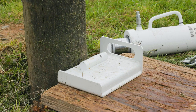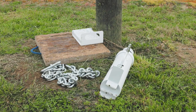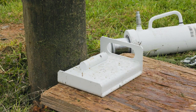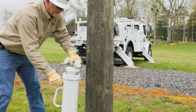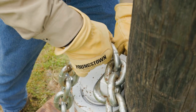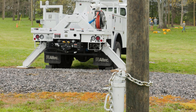Remove the pole puller from the unit or storage location and set it on the ground. Both types of pullers use a chain assembly and hydraulic cylinder to grip and lift the pole. We'll look first at setting up the Altec pole puller. Set the puller base on the ground, or supporting materials, so that the round bar on the base is next to the pole. Place the pole puller on the base so the curved bracket on the bottom of the cylinder is located over the round bar on the base. Place the D-ring on the puller chain over the lug on the rod end of the cylinder. Wrap the chain tightly around the pole one time. Insert a link from the free end of the chain into the slot of the lug above the D-ring. Do not use more than one wrap around a pole, and do not make a choke chain around the pole. This could cause the chain to break with great force. The chain could fly off the pole and seriously injure nearby personnel.